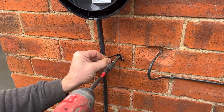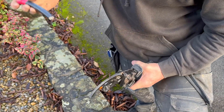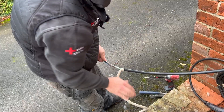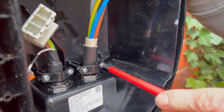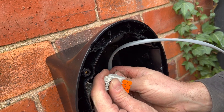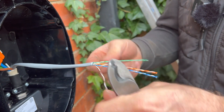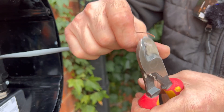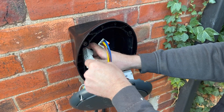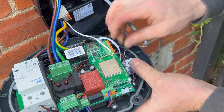A few additional clips up the wall using D-line clips so it's almost invisible. Trim the cable to length and then use the cable gland supplied with the charger for non-armoured cables. Bring the cable in — there's a cable clamp on the incoming cable to keep everything in the right place during final termination. Into the mating part of the plug and socket, using little push-in Wago-style connectors. On the data side of the cable, we only need two cores for the current transformer, but we'll leave the remaining cores available should we need to introduce a hardwired ethernet connection. Make the connector back together, plugging in the outgoing tethered lead as well as the incoming lead, and then the final push-in connections for the current transformer — no screwdriver required.